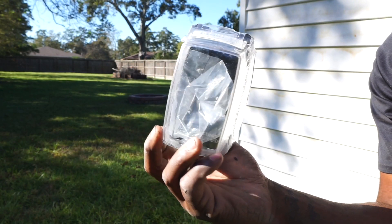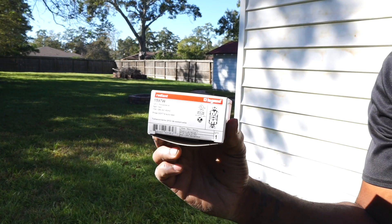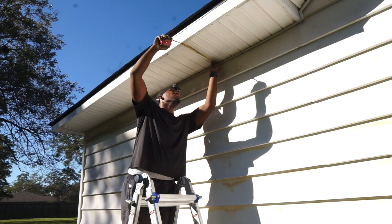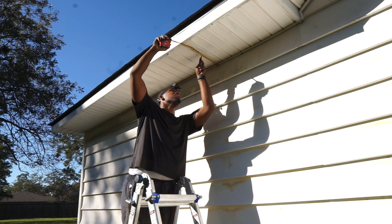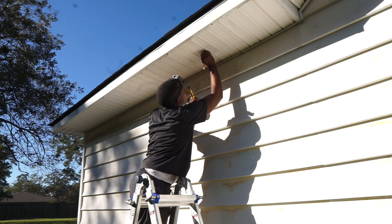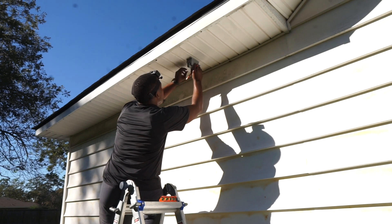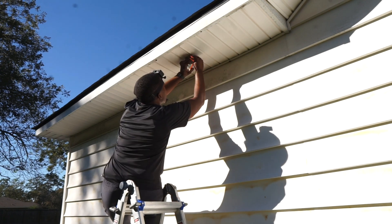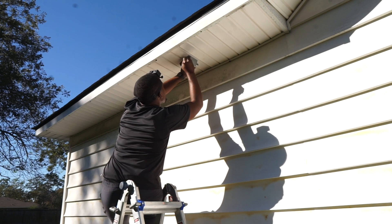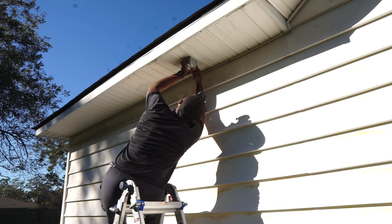Now we're outside. This is the bubble cover we'll be working with, this is the white GFCI we'll be using, and this is our single gang pop-in box. I wanted to make sure I got my measurement right and it was going to be in the middle. I'm tracing out exactly how I want it to be. The main thing for me was making sure my box was going to be straight. I had a level up there first and then traced around my pop-in box.